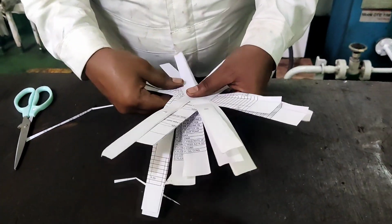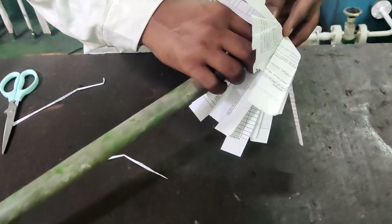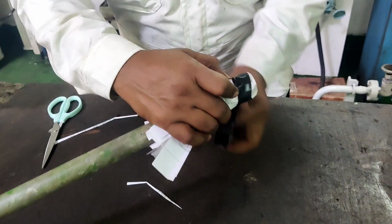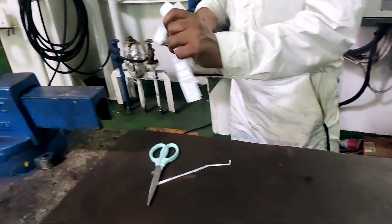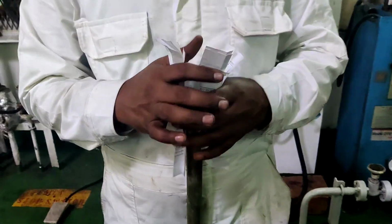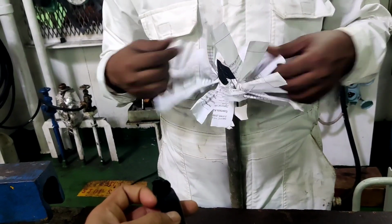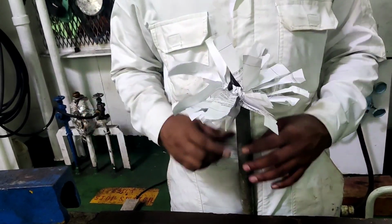On the hypermist panel you will have different sections, and for every section it gives auto and manual. The manual switch button will operate it, and every section is designated, separated for boiler, generator, main engine, incinerator, so they already have sections. Whenever you press that button, the sprinkler at that same location will give an air blow. With the help of this kit we will identify that air is coming. That means when the line is filled with seawater, seawater will also come from the same sprinkler. So now we will use this and check section by section, every spot wherever we have a sprinkler.